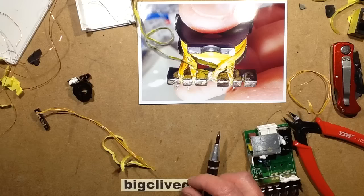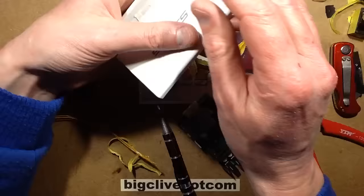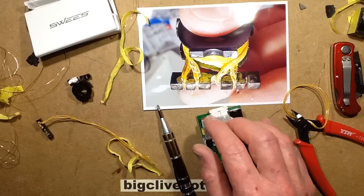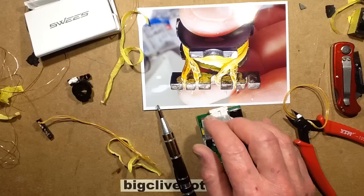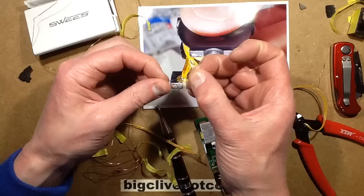These Sweez units are still on sale on Amazon — there must be others out there, probably a whole batch that went out with these bad transformers, because it was almost certainly a common manufacturing fault. I wonder how many are out there with that feedback winding just gently touching bare copper, with only that whisker-thin insulation between you and potential death. Yes, that's quite dramatic — but fun in a sort of dark, morbid sort of way. Always good to take stuff like this apart and find the little dark secrets of what was wrong.